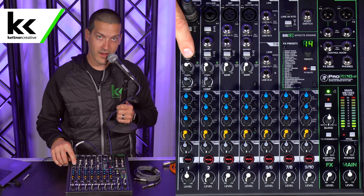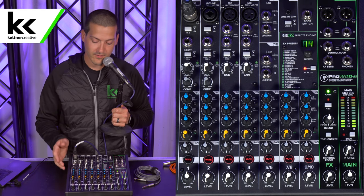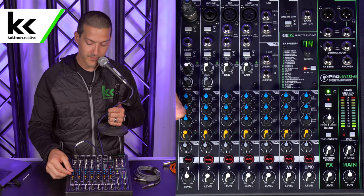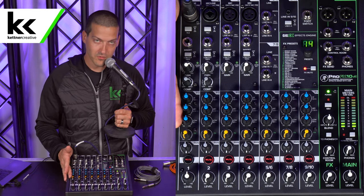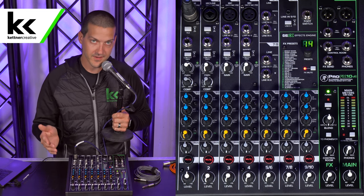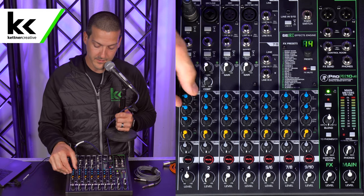I'll flick on this low cut — you should hear the lower frequencies drop out a little bit, sounding more clear. The 3-band EQ: the key is to make subtle changes. If you're doing a talking-head podcast, just leave it flat. If you're in a live environment and getting feedback, reduce the highs a little. If that doesn't work, put those back and reduce the mids. If you want to clean it up, reduce the lows. If you want more vocal presence, push the mids up. Don't make the same move on all three bands — this EQ adjusts volume by about 15 decibels per band, so turning all three down just reduces input gain by 15 dB, and turning all three up just makes it louder. If you can't hear a difference, put it back to flat.